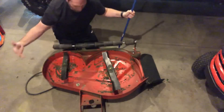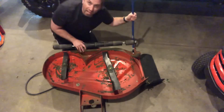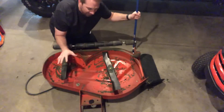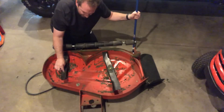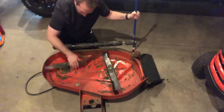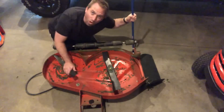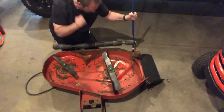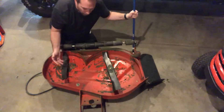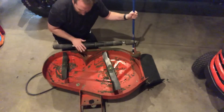If we take this a step further to even wider decks with three blades, in an ideal situation you'd have a small, medium, and large blade. The reason they don't do that is it's not cost-effective — you need three different blade sizes, your deck is a funny shape because the chambers need to be three different sizes, and people are going to put the wrong blades in the wrong positions. It's just too complicated. Engineering-wise it's the correct solution, but in practice they don't do it. This deck is unique and I hope it sticks around for a long time because it cuts so well.